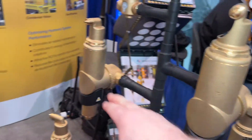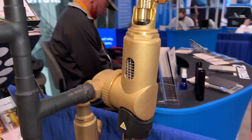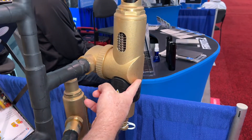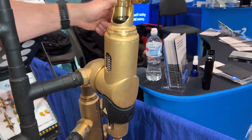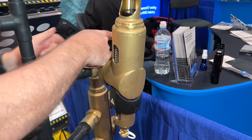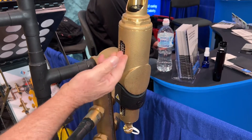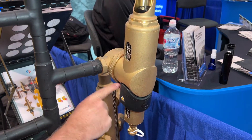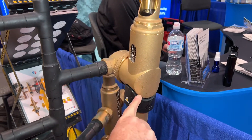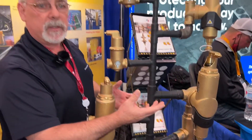It's the same element through all of the units. This one has a cutaway as well — you can see the element here. This one happens to have a magnet on it, and this magnet is designed to be in the flow path. As the fluid passes in, it directs the fluid to go upward so that it captures air in the top half of the vessel. Then as it comes back down, the debris is passed across the magnets on the sides so those magnets capture any ferrous oxide in the system. A lot of competitors use much smaller magnets — ours are much stronger.